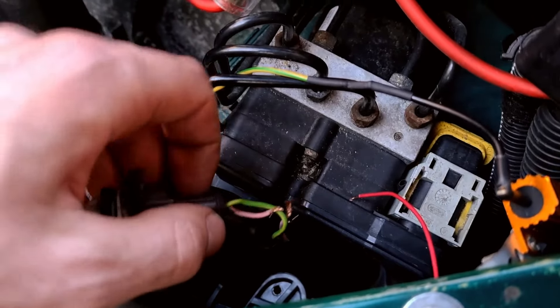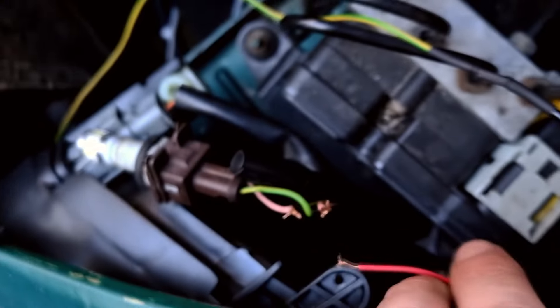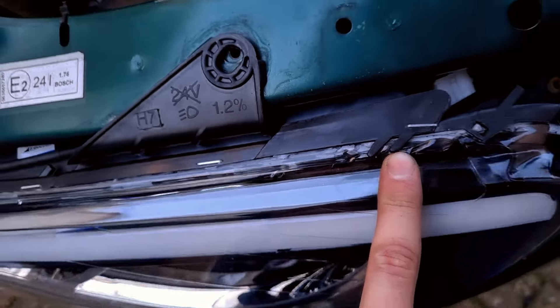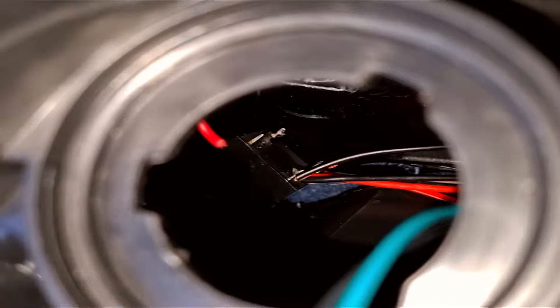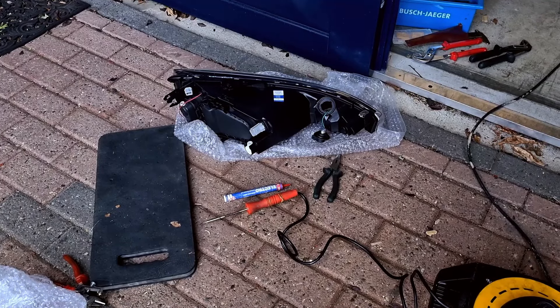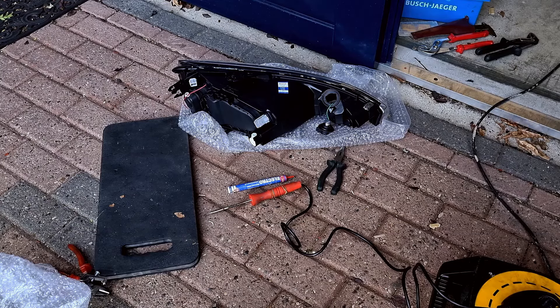It's stupid because I tested it, but this is the regular light — if you connect that it just works. But if you connect this wire to here it doesn't want to work, so I guess the problem is in the light itself. I'm going to have to take it out again and figure out what it is. So I found the problem with the light — as you can see here, this wire is loose. It's supposed to connect to that LED module back there and I guess it broke off in shipping or something. It's gonna be very difficult but I'm gonna try and solder it from the inside and add another wire to it. I've made a little loop that I'm gonna try and put onto the wire right there — it's gonna be a tricky operation but I'm gonna try it.